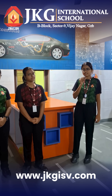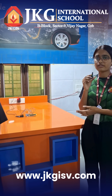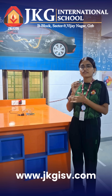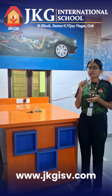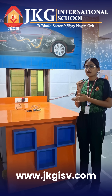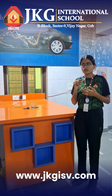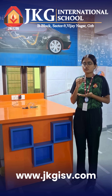Now I will explain how the model works. When the sensor sends sound waves, they travel across air and return after getting hit by any object. The sensor measures the time taken by the sound waves to return. Then the Arduino board calculates the distance using a formula: speed of sound multiplied by time, divided by 2.